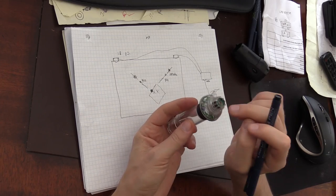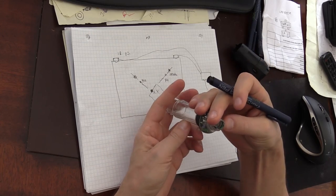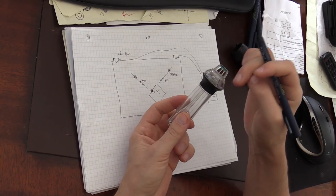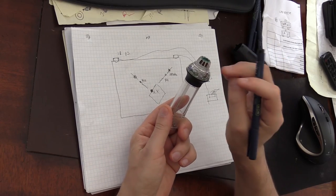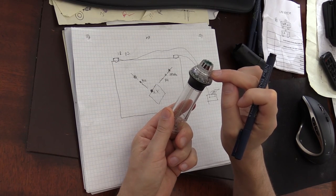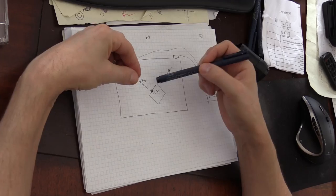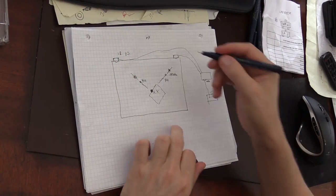The most interesting part actually is this transmitter. This is a piezoelectric element, which is made out of a very thin, flexible film, covered by metallization, or two metal layers. When a short high voltage pulse travels to this piezoelectric element, it generates a short pulse of ultrasound signal.